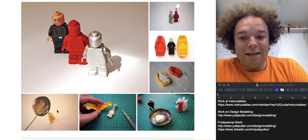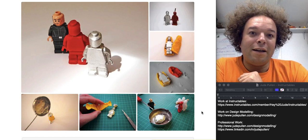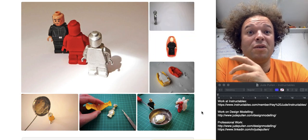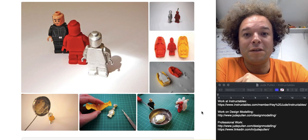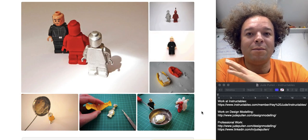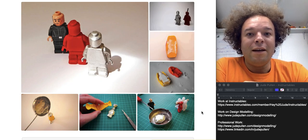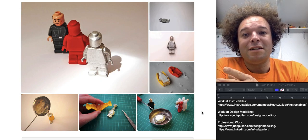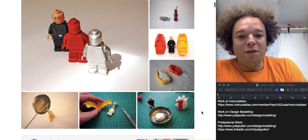I'll go through this a bit more slowly, but that's the basic full process. If you're an experienced model maker and caster, the insight is really that Sugru is super cheap and you get a reasonably good metal mold good for about five repetitions. If you're completely new to this, it's a really good primer without having to invest in all the usual molding gear, release agents, and so on — which gets expensive. It's nice if you just wanted to make a little pendant for a friend.